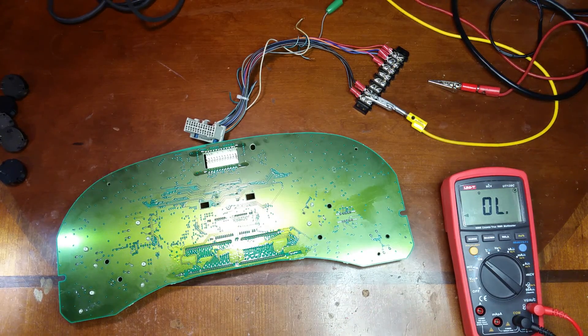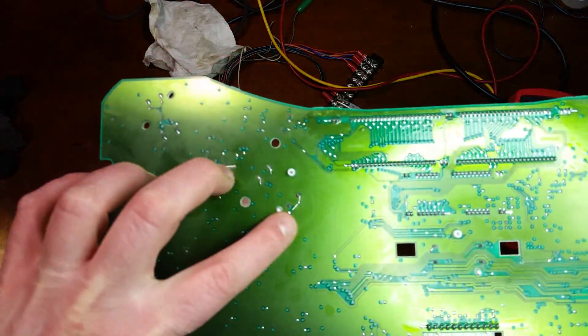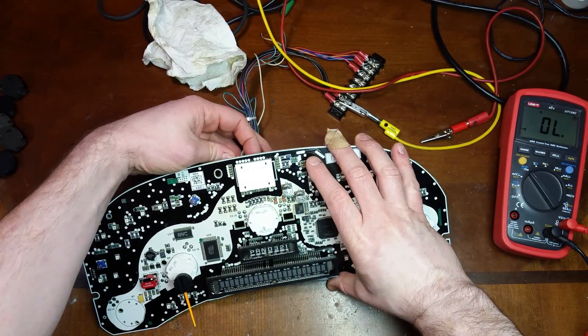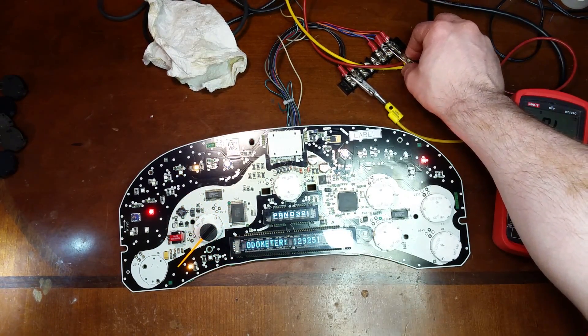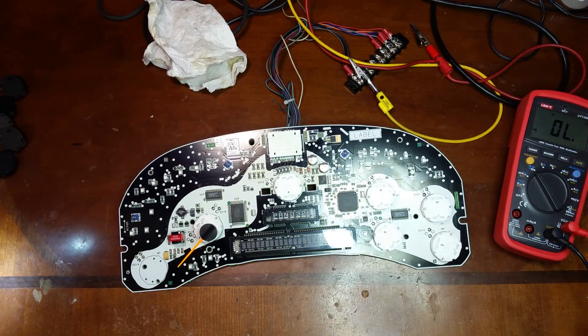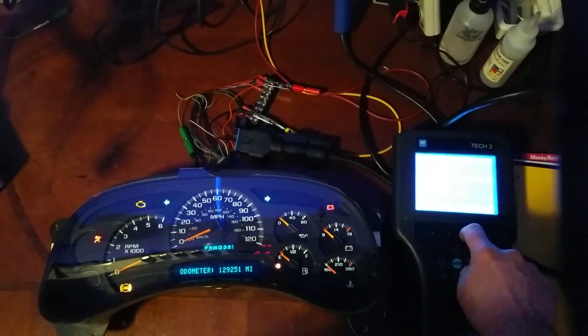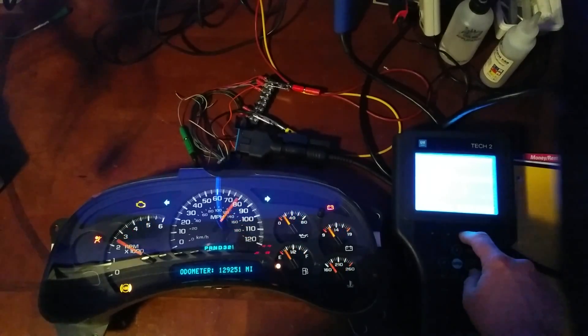We have to run one more jumper and that should take care of the RPM. Jumper ran — let's give it one more test. All right, look at that. I believe Bob is your uncle. Now I'm going to go ahead, finish it up, do one more final test. Here you have it: a proper full sweep out of each and every gauge. Hopefully maybe one person learned a lesson out there by watching this video — these stepper motors don't go into sockets on the circuit board, they are soldered in. You can't just pry them off; please unsolder them. That's it for now, thanks for watching.